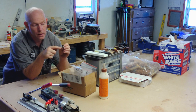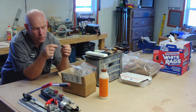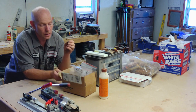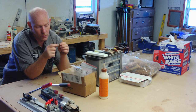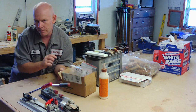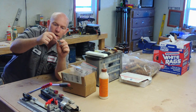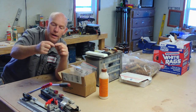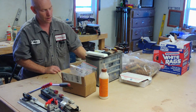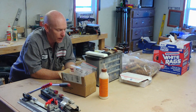This narrow end fits inside the eleven millimeter brass tube; the inner diameter is seven millimeter to fit the pen mandrel, so it will center the blank nicely and keep it stable. If you're doing a two-part blank requiring eleven millimeter, you need a center bushing — it's got a narrow end on each side with the wide end in the center, so you can run blank, bushing, blank. As you start buying more kits you're going to have to buy more bushings and more drill bits.